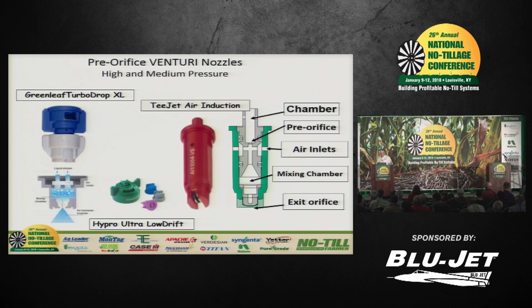Here's an air induction cross-section. The three that are on the screen, Greenleaf, T-Jet, and Hypro, those are three common ones. There are some others. But I have a cutaway here of the air induction version, the long stem, about 2 inches long. You'll see the chamber, the pre-orifice, the air inlets, and the Venturi, which is right there. The Venturi is a narrowed passageway. What that means is when the spray solution gets into that narrowed passageway, the speed and pressure change.